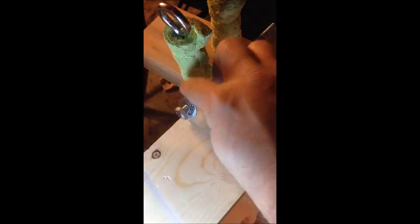When we assemble the frame, we want to avoid the screw heads protruding over the surface of the wood, creating wear and tear to the raft. We make through holes that can hide the heads but still hold the washers for assembly.